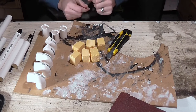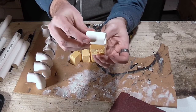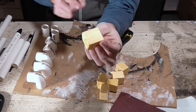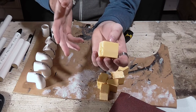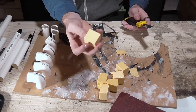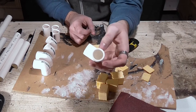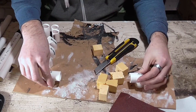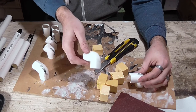While the gap filler on your joiners is setting, take your foam board and get some blocks cut out — about this big — so that your joiners have something to raise them up off the ground. Try to make them as square as possible. Cut the rough ends off either side to neaten them up. Make sure you have enough squares for each of your joiners. The 90-degree bends are exceptions — two will be used for the pipe coming up out of the ground, and the other 90-degree bend will be laid on its side on a block so the pipe can bend at 90 degrees.